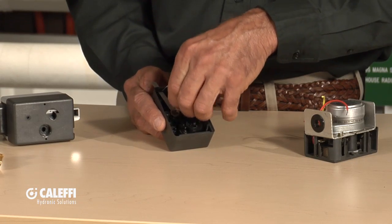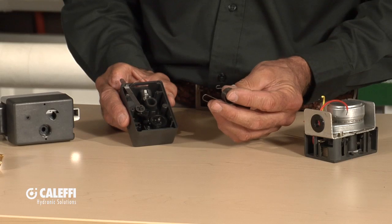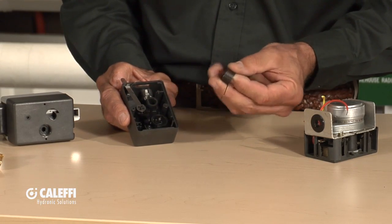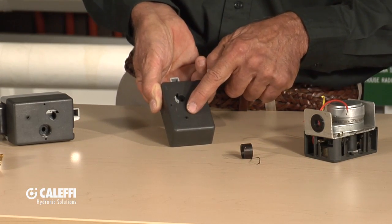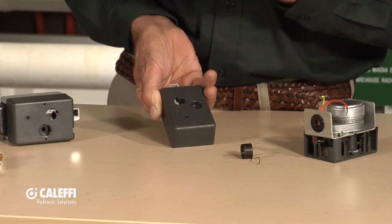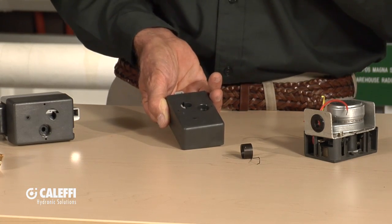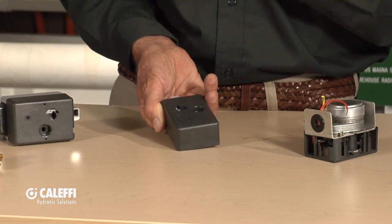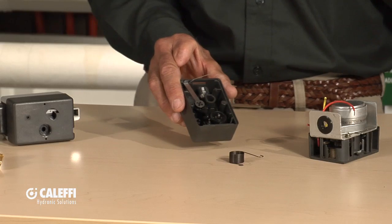What that allows us to do is put a higher tension spring — a higher close-off spring — because we've got more ability to drive that open and close with a better gear train in the 20-to-1 reduction. With this type of spring we can wind it more accurately. We put it in, flip it over, and on the back there's a little square plug. We actually use a torque meter to wind the tension on that spring. So every one of these comes from the factory with exactly the right amount of spring tension, and it's going to have a higher shutoff pressure than most valves on the market.